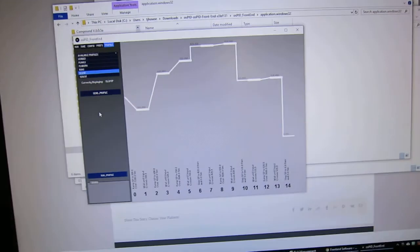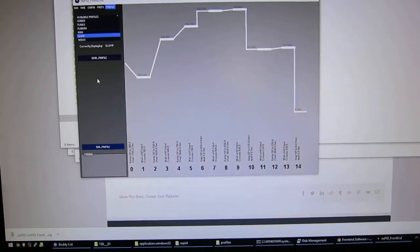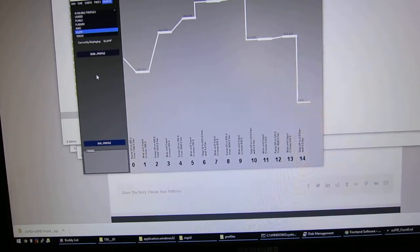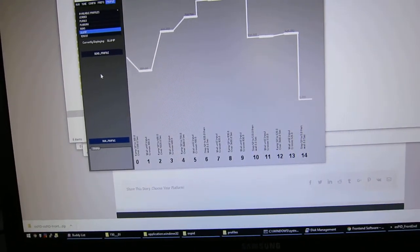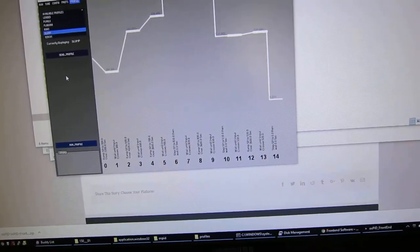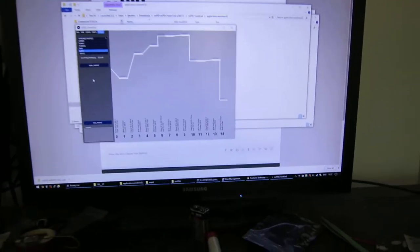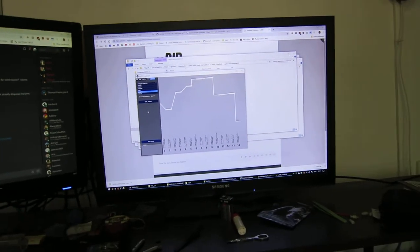I wanted to do that because I'd made, long ago, the profiles to do glass slumping and tempering. This is the profile I'm going to use - I loaded the software into my desktop. It ramps to 300 at 7200 degrees per second, so it just goes bang straight to 300, then goes to 600, then 700, then 820, then up to 830. That drops down to 510, and then for some period of time goes up to 520 and back down to zero - so off. I don't remember the science behind any of this, but I know that it works - I tempered some float glass with this and it worked amazingly well.